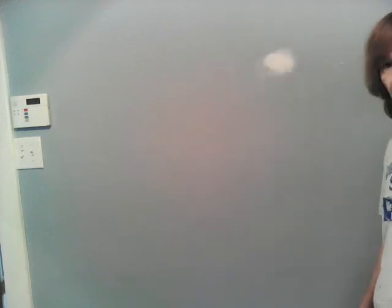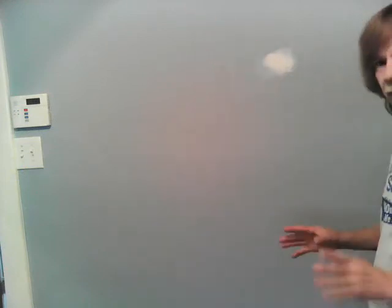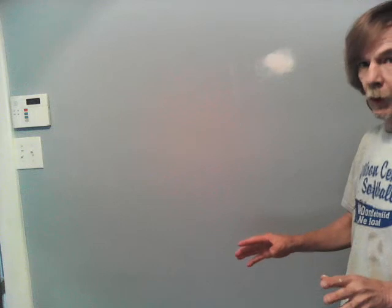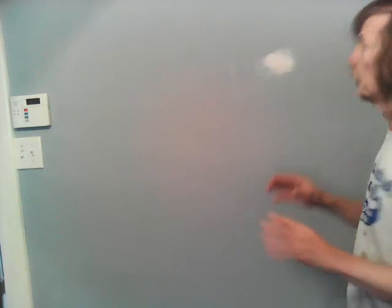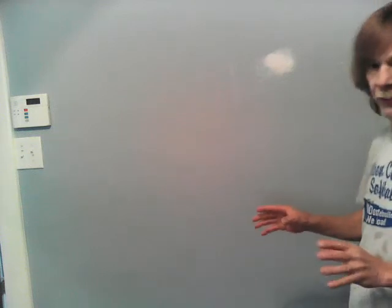Anyway, because this kitchen is blue, I had to match the wall. They didn't want me to paint the rest of the kitchen, so what I've done is match this wall to the adjacent walls. Now the thing about matching — you don't have to make it absolutely perfect, but when you're cutting in you better do it perfect or it will show on the adjacent walls.